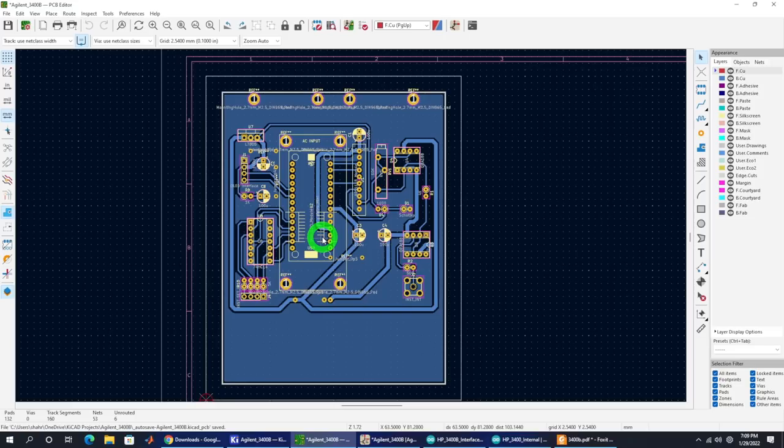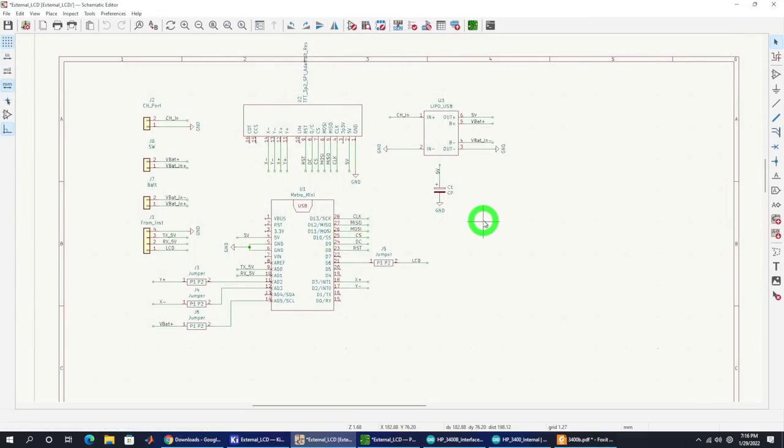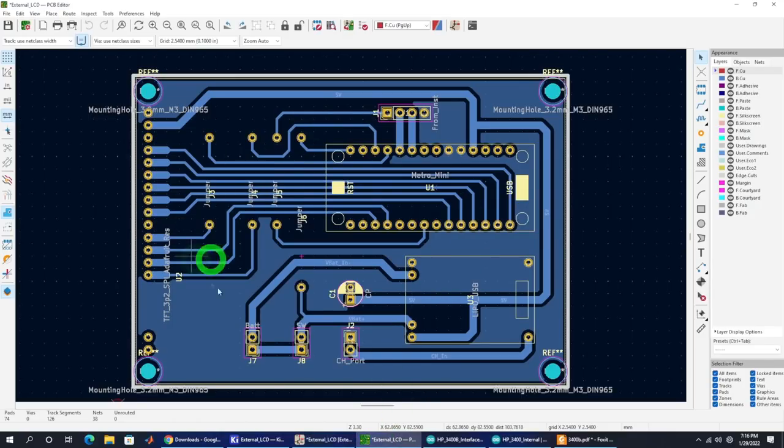There's also a board that goes outside to drive the LCD screen. The data coming in over RS-232 feeds into exactly the same microcontroller. This technique mirrors what instrument manufacturers do — keeping the front panel completely separate with its own driver, own LCD, and own operating system, separating everything from the sensitive analog stuff. The digital data is fully interpreted by the external board, which is responsible for generating GUI elements on the LCD. Libraries for driving these LCD screens are available, and we're using an Arduino platform.